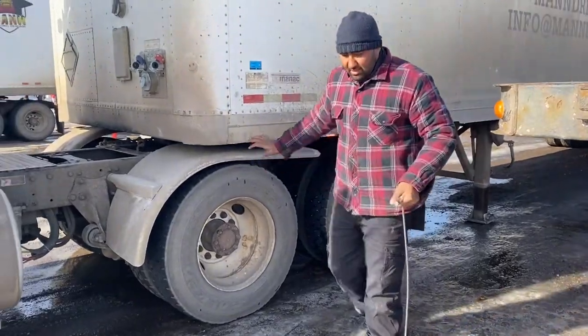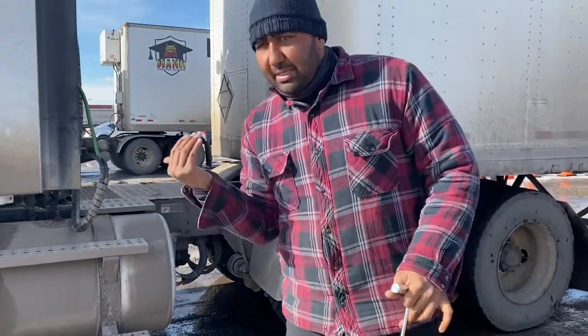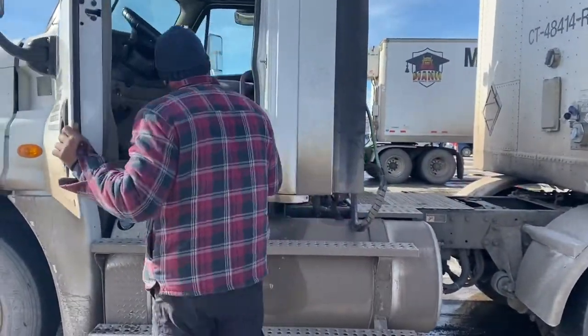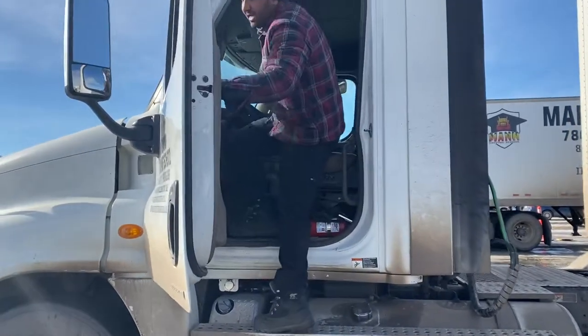In case my kingpin is not pulling, there's stress over there, I can back up my tractor a little. So now I am going forward. Make sure I go 1 foot forward and drop my air. Don't go all the way out. Always make 3-point contact inside and out.